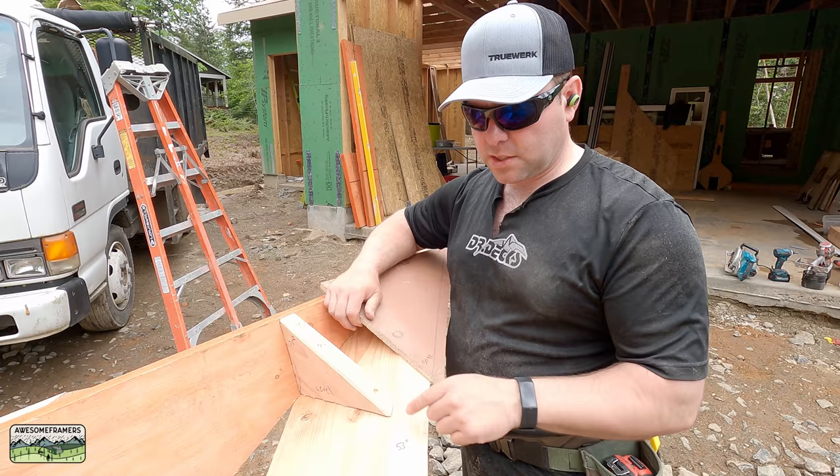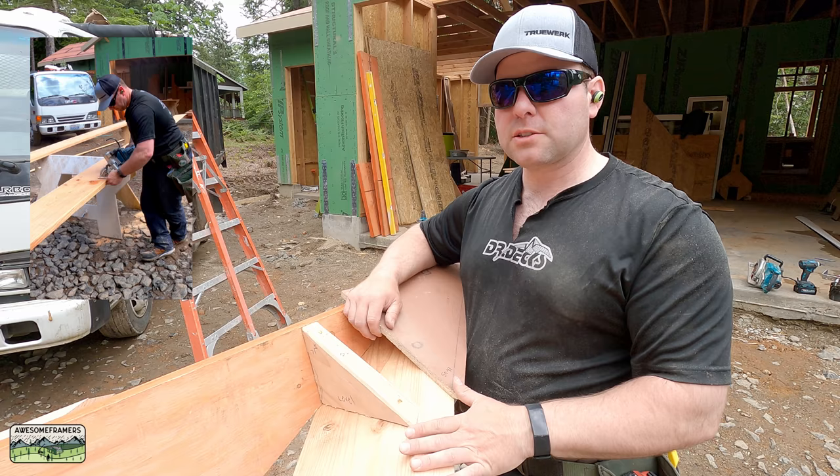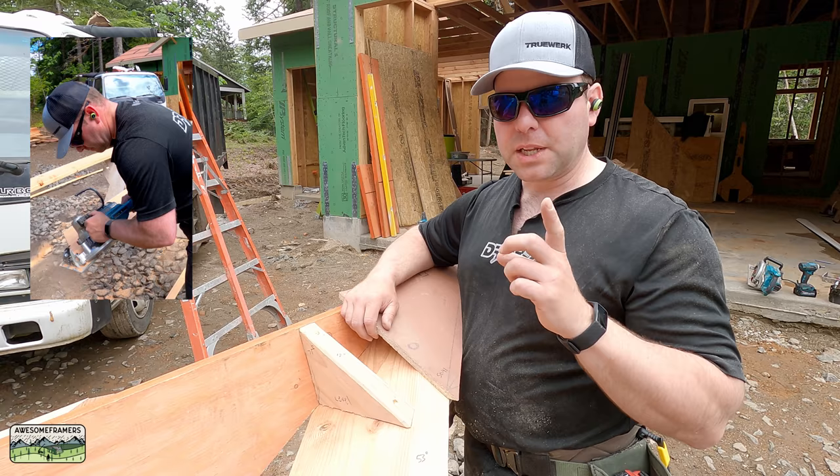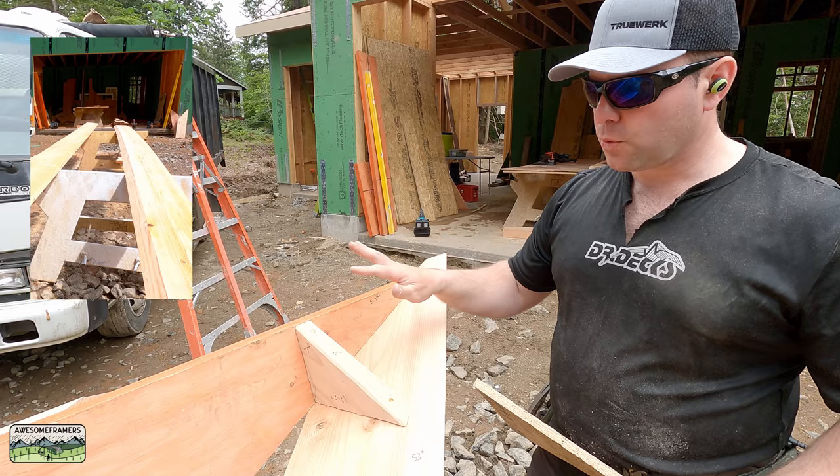As of yesterday we recently started beveling our sleepers — this is for an over-frame valley. We've literally not done that in 20 years, but seeing Ben Morton do it convinced me it's worth it. It took about three minutes to rip a 22-foot 11-inch sleeper. We pre-cut all of our jacks before assembling, and this 12-inch works right on the money.